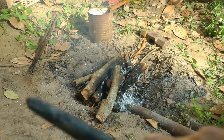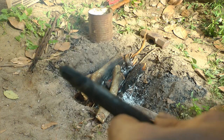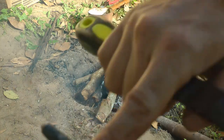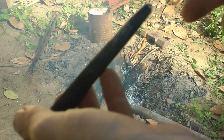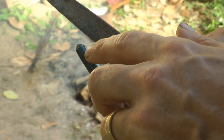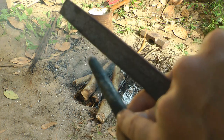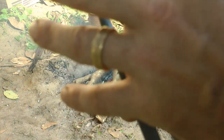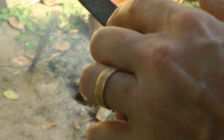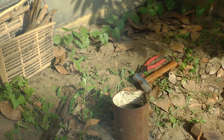The next step is we need to soften this back up again, but not make it as soft as the unhardened end — soft enough that when we drop this it's not going to break, because it's still brittle. We don't want it like a file; we want it to actually punch holes. The best way is to clean it to a shiny state so we can see the temper colours. Temper colours indicate what temperature the steel is at. A light brown at the tip is around 250°C (about 480°F). The blue we want further up, and purples below, are way higher — like 600–800°F. The tip will be a little harder but soft enough it won't break. That's what we're doing when we're tempering — differentially hardening and differentially tempering this tool.